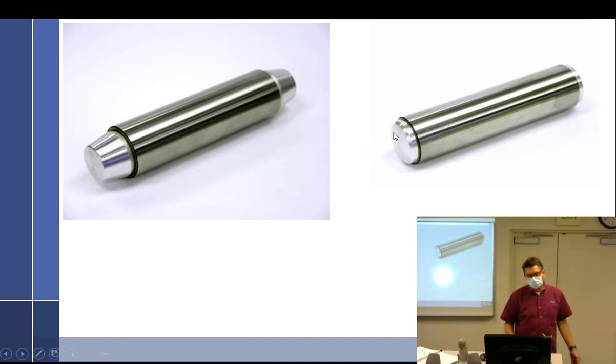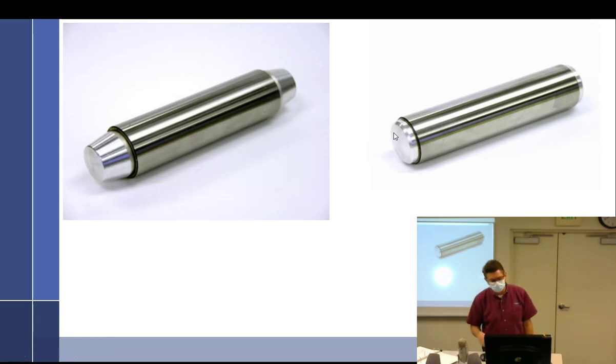And what had happened, we were getting a high aluminum content, or the owner was, wasn't my problem. On the smaller Continentals, usually when it's high aluminum content, I suspect piston pin plugs, and I'm almost never wrong on that one. And this particular one, we pulled the cylinders until we just found that thing. It had been chewing up that piston pin plug.